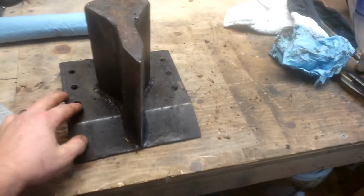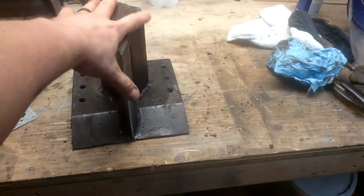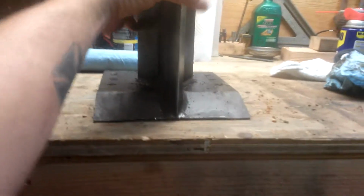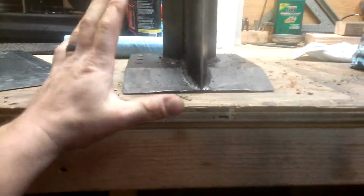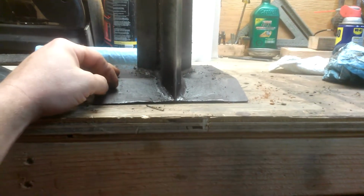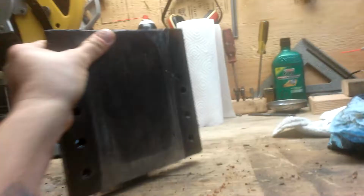What was happening is this thing was loose. Well, it wasn't really loose, but long story short is that this thing is allowed to do this as it's running down that I-beam. And it's getting a bunch of wood caught between this wedge and this runner, or whatever you want to call it. And it's getting caught between the I-beam and the bottom of this thing underneath here.